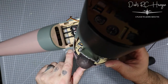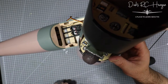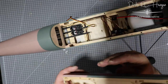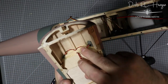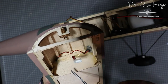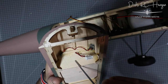Now about the switch — you can see inside there in the corner a little LED. That's why I decided to put a white LED on here, not red. When I push it on, it stays on as long as voltage comes out, so I know I'm getting power to the engine — the glow plug will be powered. Underneath I just put another one of those plugs on and put a bit of balsa across there so the cables don't tug on the electronics.